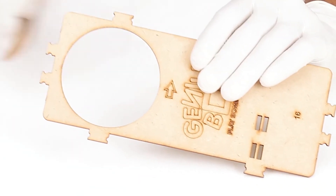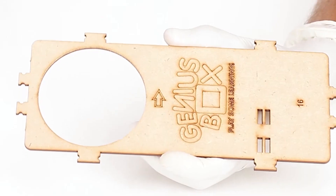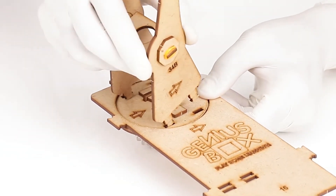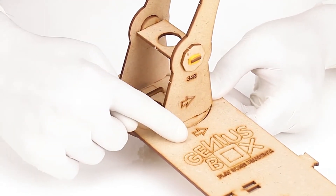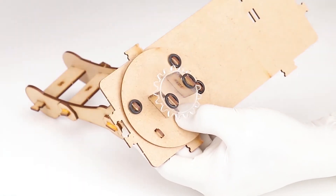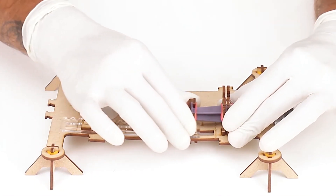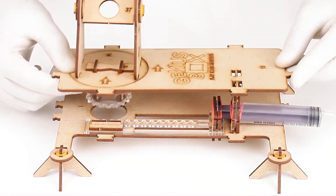Take part number 16, rub the circular cavity with sandpaper and apply wax on it, then place it over the gear set. Make sure the arrow on part number 14 and 16 are facing in the same direction. Take the vertical arm and make sure the arrows on the vertical arm and part numbers 14 and 16 are all facing in the same direction. Insert the slots of part number 14 and secure by four black washers below. Make sure the syringe in the base stand is fully compressed and all arrows are aligned, then place the gear set over the base stand.